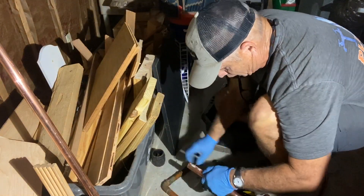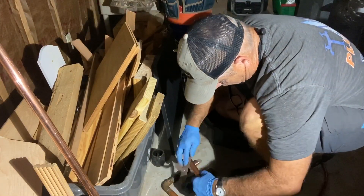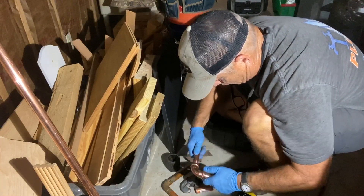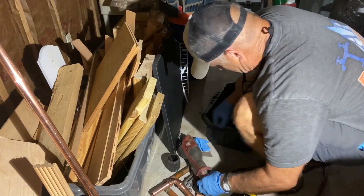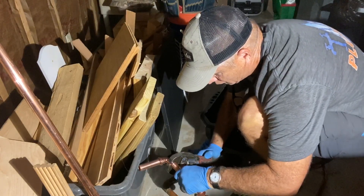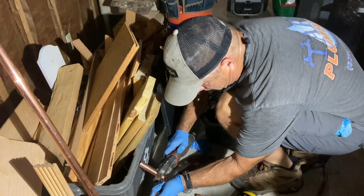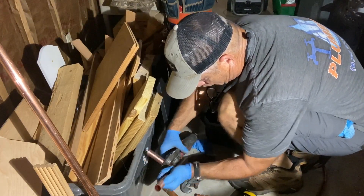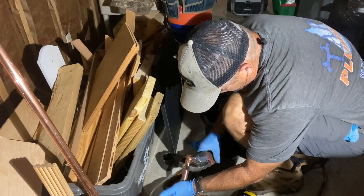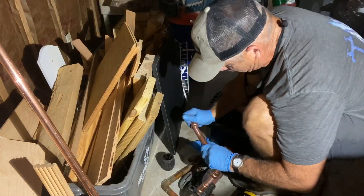They've been making them the same way all that time. We will leave a link in the description below to those. That mesh sand cloth right there is excellent — it doesn't ruin as soon as you get it wet. And here's the press that we like to use. Most people are not going to go out and get a press, but for anyone entering the trade I would definitely recommend going ahead and getting one if you're going to work with copper fittings. This is the lightest and most compact one we could find. We'll leave a link in the description below to all of these things.